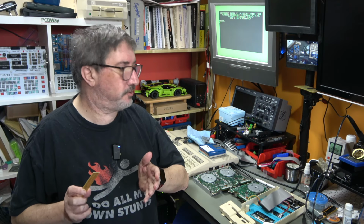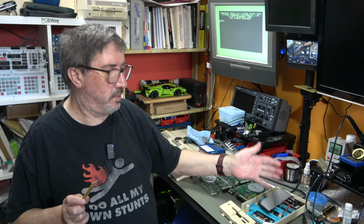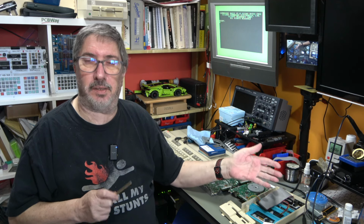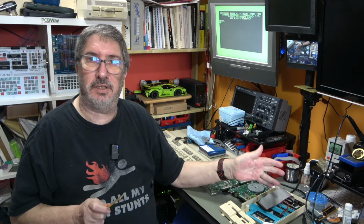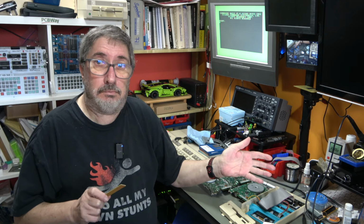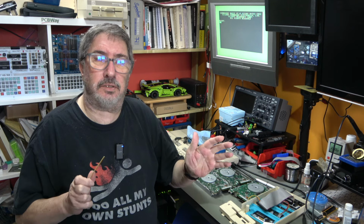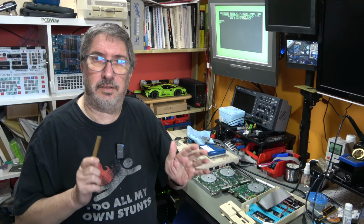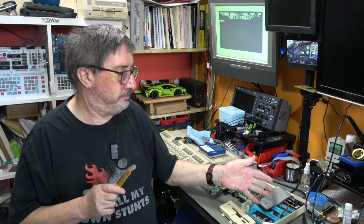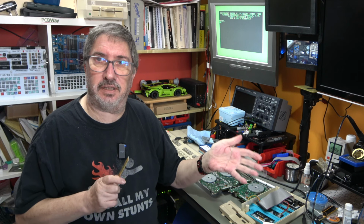Now, I've got it such that this drive works with a converted Amiga drive, and it works with a PC drive through the adapter and so long as that is not an SFD321B. So I could leave it there, but I want to know why the SFD321B does not work with this drive if it is in PC mode. So there has to be a difference between using an adapter and converting it to an Amiga drive.